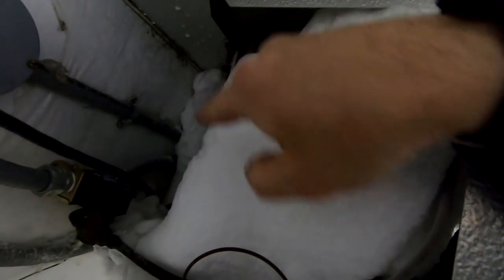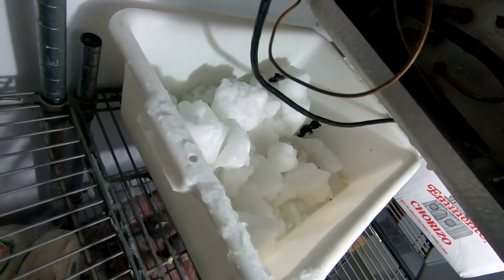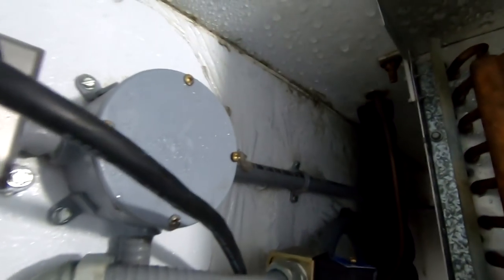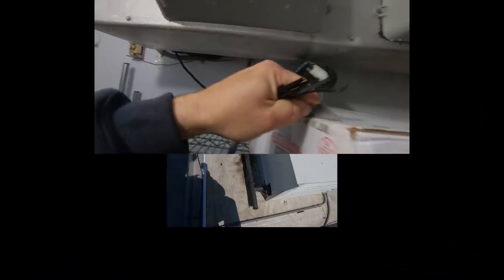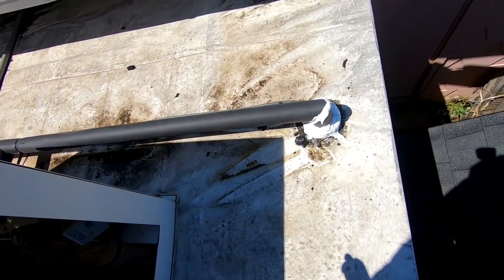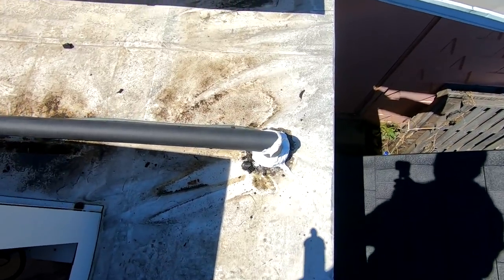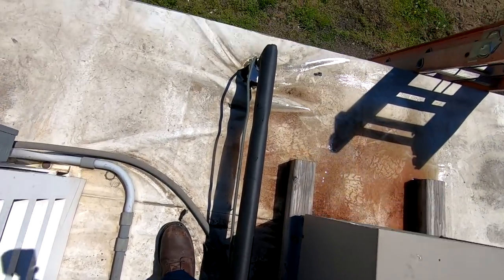That's kind of a tricky spot to get to — I may have to melt that out with my pump sprayer. What's been going on is up above the ceiling it's just been dripping down, and I'm pretty sure there's no insulation left on that. This is just the moisture from that which I believe caused it to freeze up like it did. My focus is going to be on this part here. Got it all melted out using my little pump sprayer. Using wire ties since I couldn't get it to glue or tape — there's just no room in there. All finished up, got her all sealed with the Armaflex caulk. Made a big cap around it and did my top corners too just to be safe so it doesn't come apart. Got the cooler insulated and added some of that around that one too.